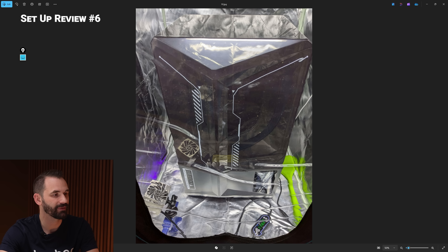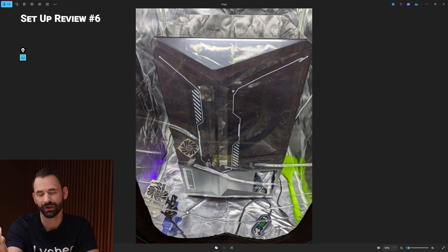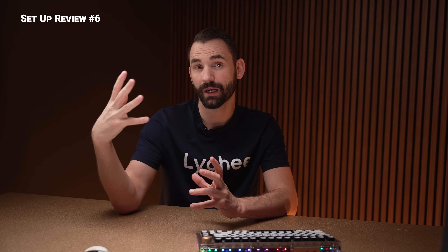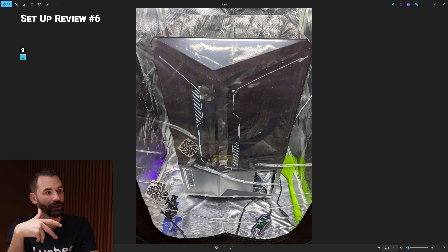This is another setup — they've got the Anycubic heater inside of the grow tent rather than inside the resin, which is probably a better way to do it. You'll still heat up some components of the printer, so watch your temperatures. You don't want to make your grow tent 28 or 30 degrees Celsius — that's going to wear down the printer components faster. You want the printer body chassis a little cooler and the chamber a little hotter. I'd probably keep the chamber around 22–23 degrees Celsius so that the resin will be warmer, and that way everything will last a long time.